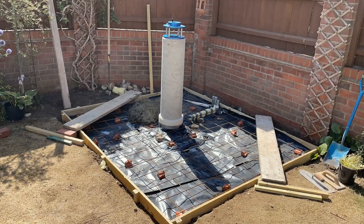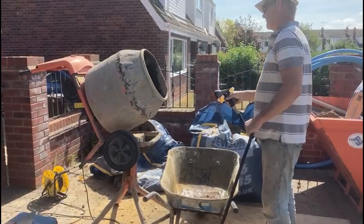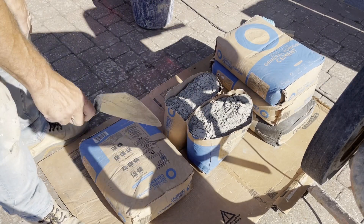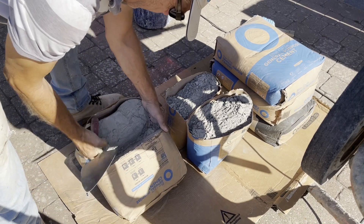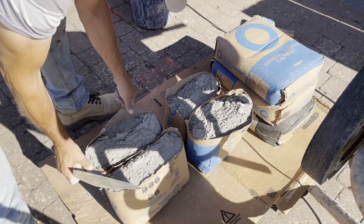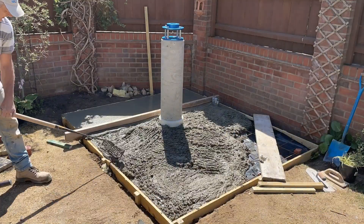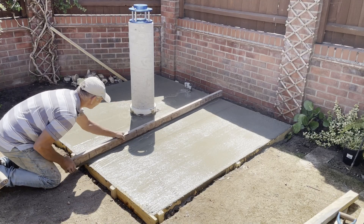The steel mesh is in place and I'm now going to mix up the concrete for the base. This mix is going to be a four-to-one ratio — four ballast to one cement — and you don't want it too wet but you want it mixed nicely. A little tip for opening bags of cement: use a decent-sized trowel, cut down the middle, carefully lift it up from the back, push it together, then come up from the bottom with the trowel and you've got two nice half bags without any mess.